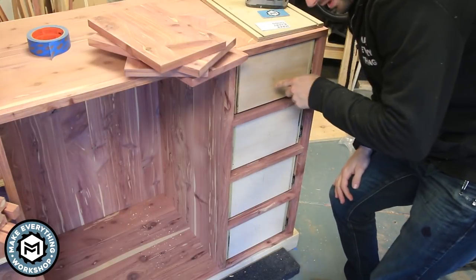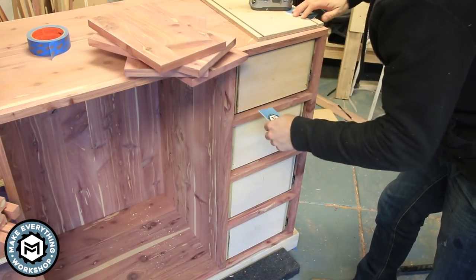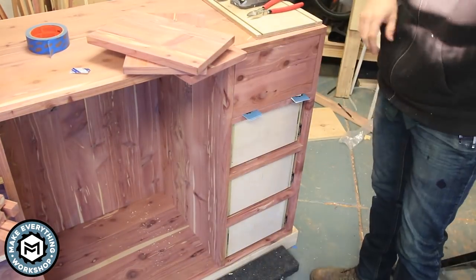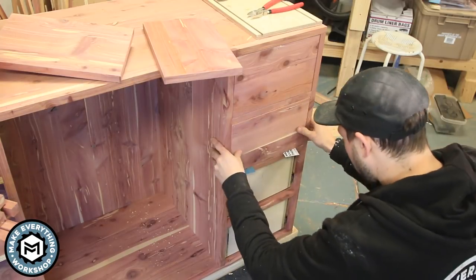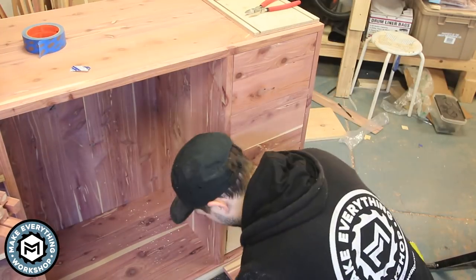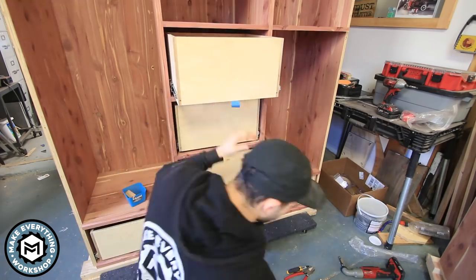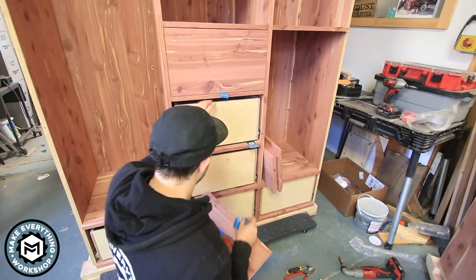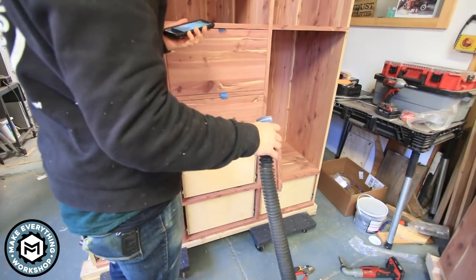Here's how I like to do drawer fronts: take a hot glue gun, put spacers underneath the drawer front, put two dabs of hot glue, stick the drawer front on, then go back and use screws. I've been doing this for a while and it works really well. The cordless hot glue gun I'm using is about $30 from Home Depot - it's Ryobi and uses Ryobi batteries - but to have a cordless glue gun on the job site, you'd be surprised how much you'll use it. Something I didn't do on the last set of drawers was add tape to pull them back open, so I had a bit of a struggle getting those open afterwards. I'm using business cards as spacers for the drawer fronts, which gives me enough clearance so they open and close really smoothly.